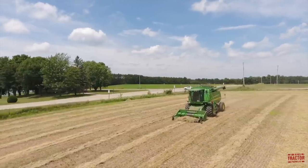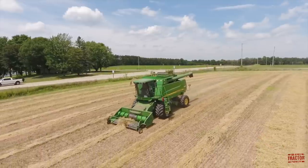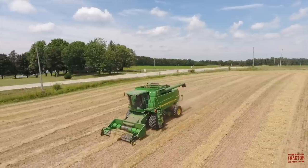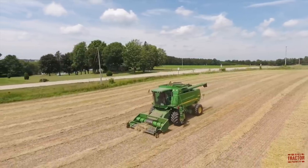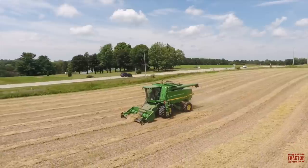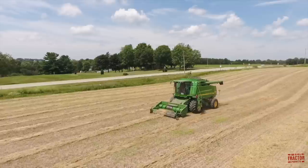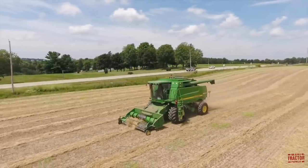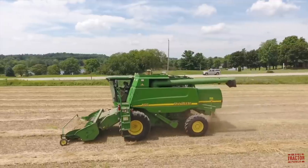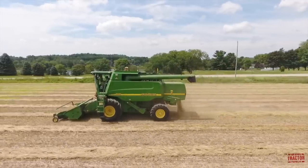John Deere introduced the new 50 series range of combines for model year 2000. This was the largest selection of combines offered by the company to that date. There were six new 50 series machines, which included two rotary STS combines, a CTS small grain and rice special combine, and three traditional cylinder walker combines. The model 9550 is the mid-range combine in the 50 series straw walker lineup, which starts with the 190 horsepower, 182 bushel, four straw walker model 9450, and is led by the 275 horsepower, 240 bushel, five straw walker model 9650. The 9550 is powered by an 8.1-liter John Deere PowerTech 496 cubic inch engine rated at 220 engine horsepower.